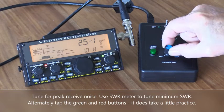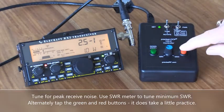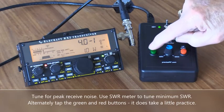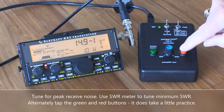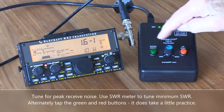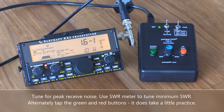Take the rate control and set it to about 9 to 10 o'clock. Turn it on and just touch it up a little bit. Going the wrong direction at first — that's okay. We get readings of 4 to 1, 16 to 1, back down to 1.1, then 1.6 to 1 — that's very good. By alternately touching the up and down buttons, you can get it very close.